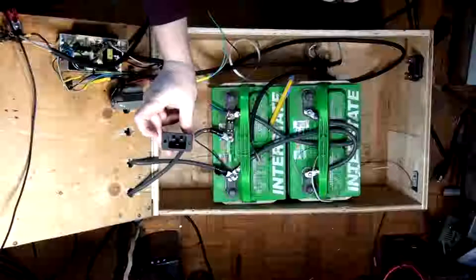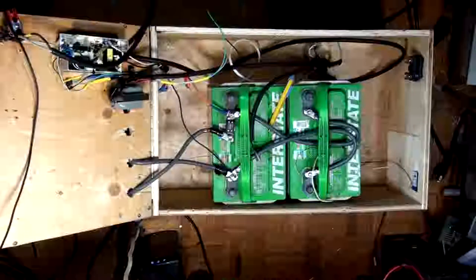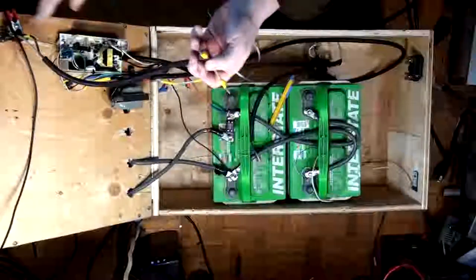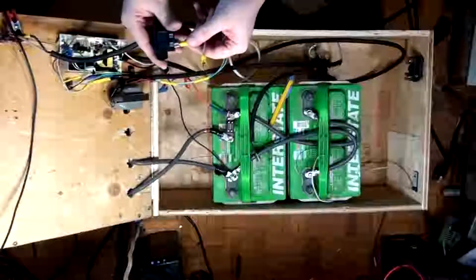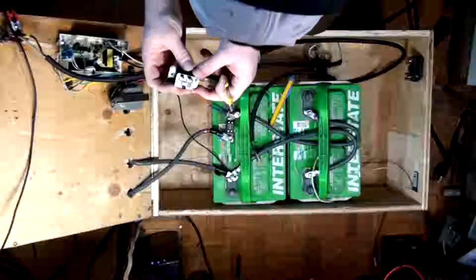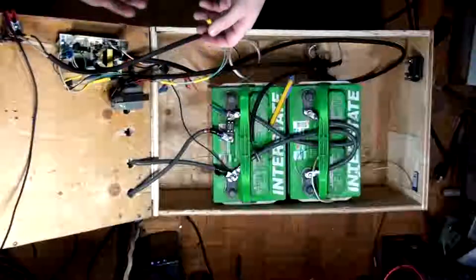See how it's kind of funny? It's all flat. So I've got a 20-amp right there. So I'll pop this guy in here. And then this is the inlet fuse that I put on here. This is just the inlet fuse off the mains, so I made it an inline. So this will plug into the hot here, and then it'll feed the hot right there. So now I'm just going to make sure these ones, yeah, they're labeled line and neutral. That's great. So now I can pop this guy in here.